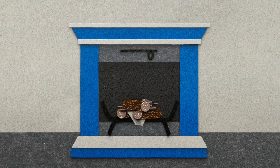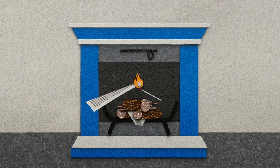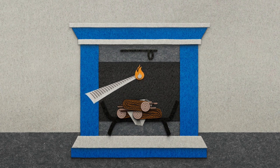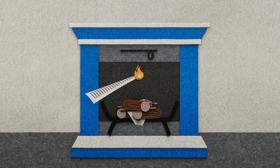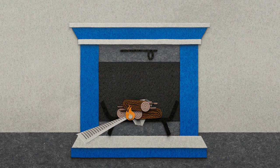Now it's time to light the fire. Twist a single sheet of newspaper and hold it in your fireplace. Carefully light the paper while holding it up as high as you can in the fireplace. This can help establish a nice draft, allowing the smoke to travel upward and out of your chimney. Next, light the kindling with the burning paper.